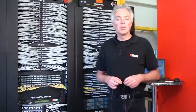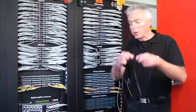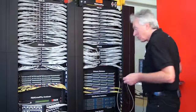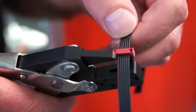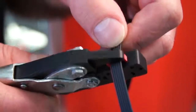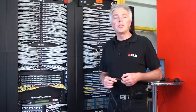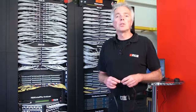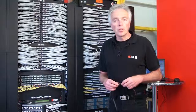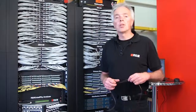The bus cable is fully field installable. We use connectors and a simple wiring tool which allows us to terminate connectors in the field. A unique feature of this bus is that it can extend over several cabinets. A single analyzer can have up to 40 sensor bars connected to it and can extend over several meters, covering several cabinets.